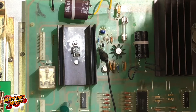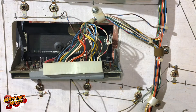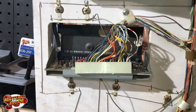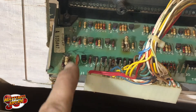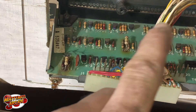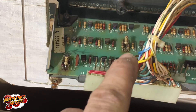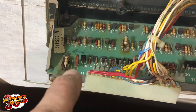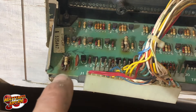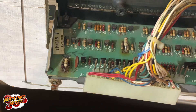I've also gone through all my displays one by one and made sure their little driver boards were good. There are a lot of 100-ohm quarter-watt resistors on them — here's a good example, this bank and another bank above. The middle ones on this display driver were completely shot. I put half-watt resistors in there instead of quarter-watt, and I ordered enough to do all of them. I'm going to change all of them to half-watt to prevent them from burning up.